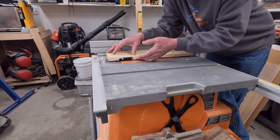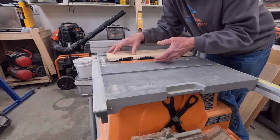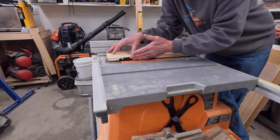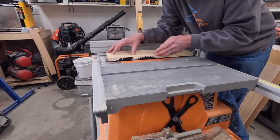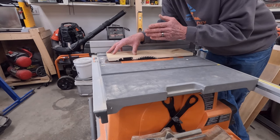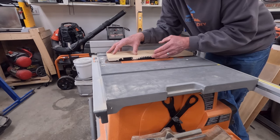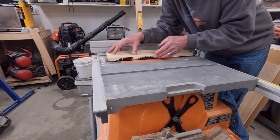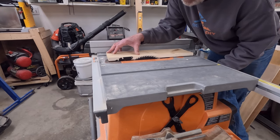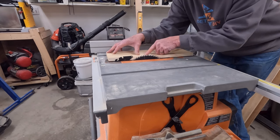When you are cutting a piece of wood, the blade is not exposed on the side inside the wood, so it struggles to bring in as much cool air as it can. The gullets cool as they go around underneath the saw, but they can still carry more heat this way. What can happen is the edge of your board can burn, and secondly it's more dangerous because of the friction created by carbide rubbing on the side of the wood. Best practice is to cut with the bottom of the gullet at the top of your workpiece.